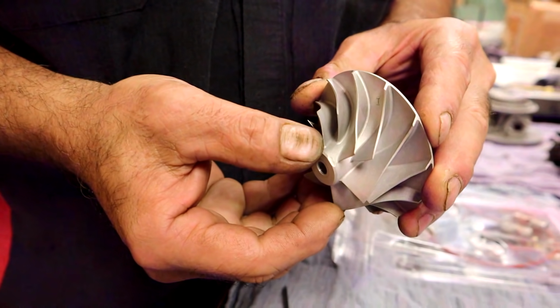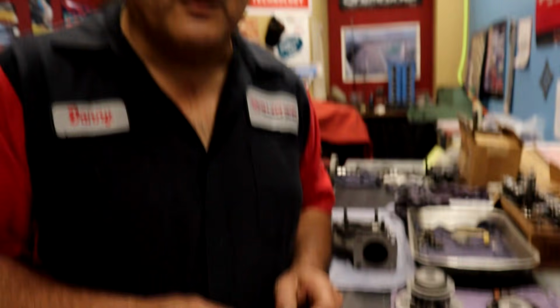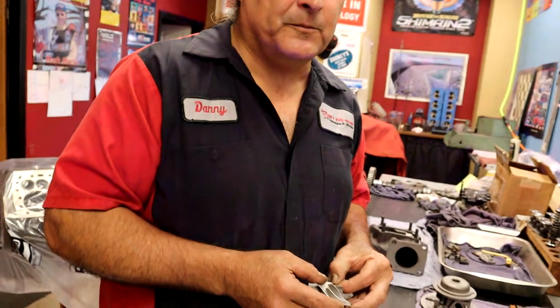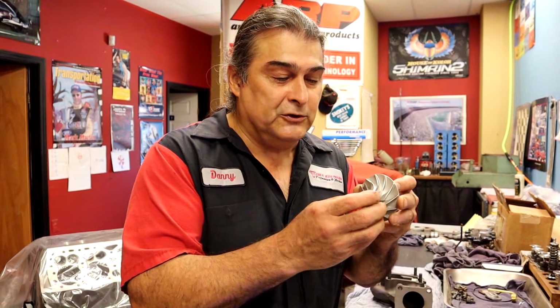So this really then is finding the smoking gun. So this is a good thing. We can see where the wear was, and by replacing our bearing bushing, it's going to tighten up our clearances by 5/10. So it was working before, but it was already loose. Now, it could have gone over and touched the side. It was a little loose, but it spun fine under extreme load.